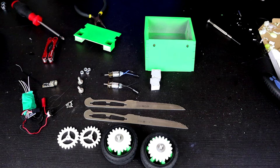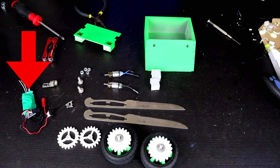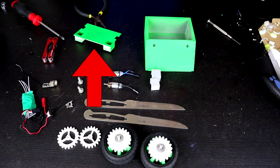Once the chassis is painted, it is time for full assembly. As mentioned, I was going to make these a lot less powerful than the last version, so I opted for N20 gear motors for drive. Everything going into the robot includes: N20 gear motors for drive, two knives, some gears, output gears so that the N20s aren't directly connected to the wheel — because I knew kids would break that setup — a custom ESC, a receiver, the base itself, some clamps for the N20s, and a top plate.